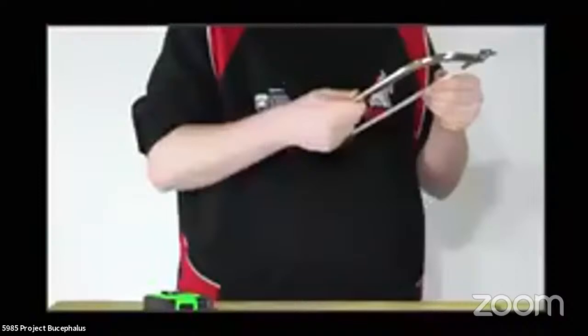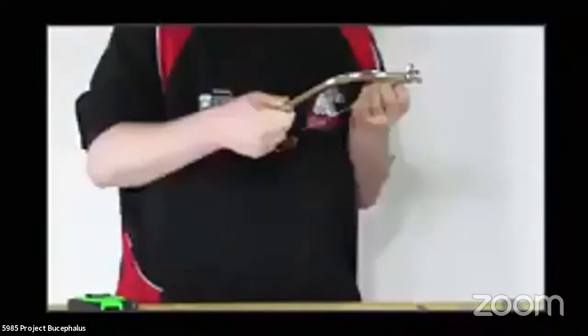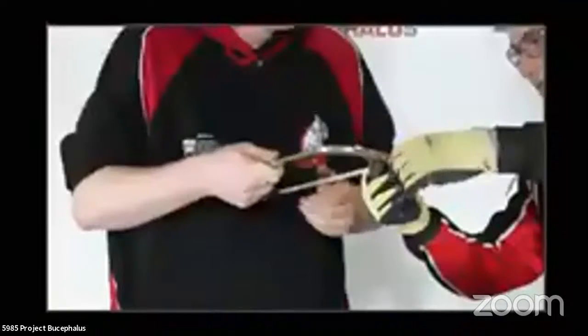That's something you need to be careful of when putting a blade in, because when you tighten it, the blade will be under tension. If it isn't sitting in the spikes properly, it will eject itself and potentially cut someone. You need to make sure the actual frame itself is sturdy.